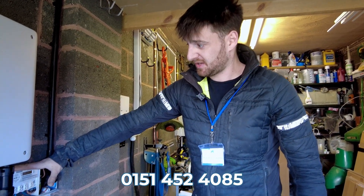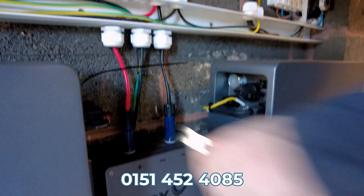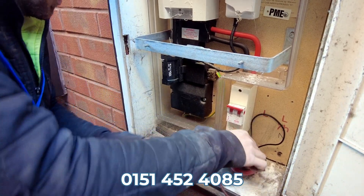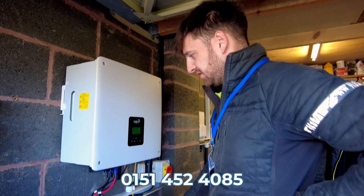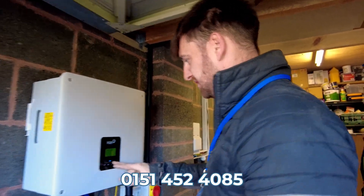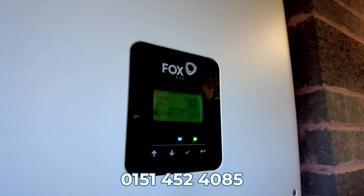And again, MCS regulation — generation meter. I'm pre-commissioning the inverter, making sure that the batteries are available to run the house. So when we fire it up with the PV connected, we should already know that it will all run and it's not going to give us any errors. It's good to go — and it is putting out 100 watts at the moment, which is just what the house is demanding.